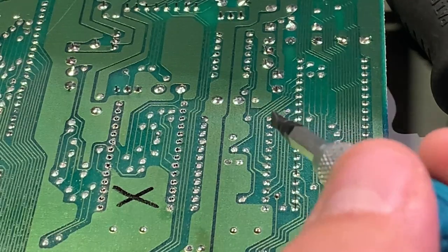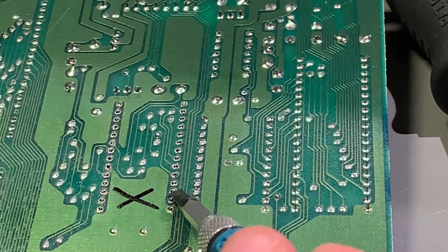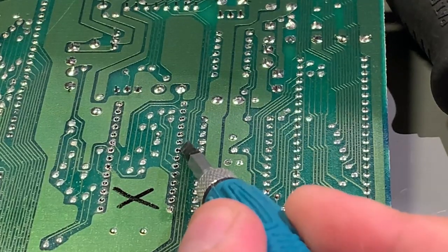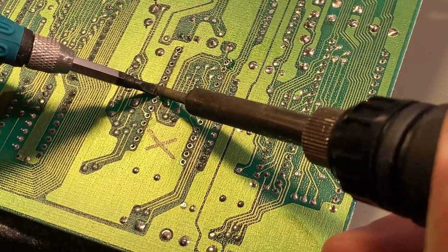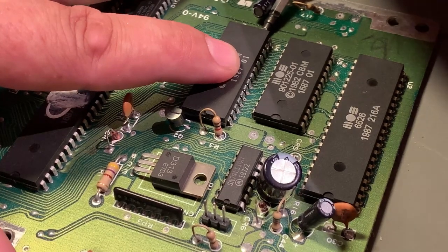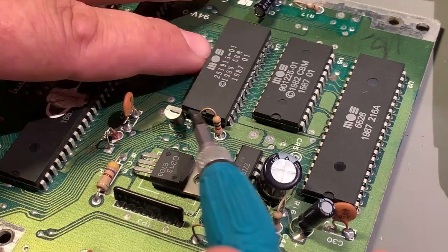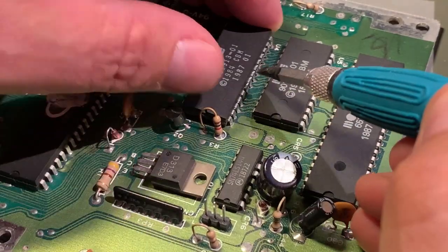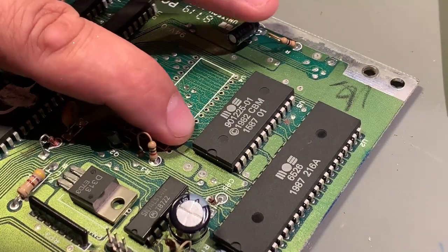That was the desoldering, however the chip is still stuck — some of the pins are still soldered onto the sides of the holes. I always go through with a screwdriver or wiggle every pin to make sure they're loose from the hole, then gently lever the chip up. The biggest risk is lifting off some of the pads. It's quite loose on one side now... there we have it — no lifted pads, excellent.